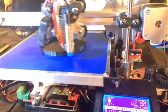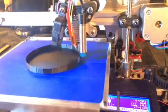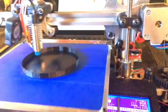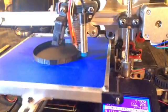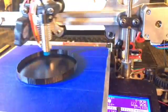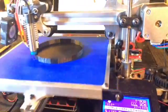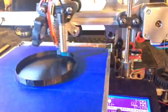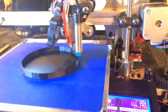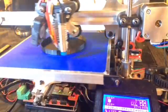There's just not enough weight to make any difference there. Now if I increase the current to the stepper drivers underneath there under the table, you could probably get a little more stability, but you're also running the risk of the stepper drivers heating up. The motor shouldn't heat up because the aluminum plates that make up the frame act like a massive heat sink, same with the 2020-2040 extrusions. Heat shouldn't be a problem unless you really crank up the current to the stepper drivers, which I'll preset those so that they're in a safe limit.